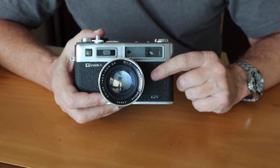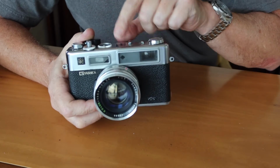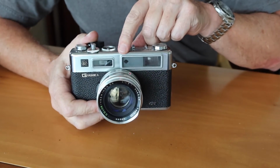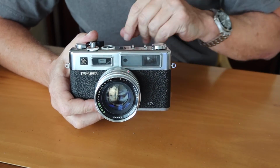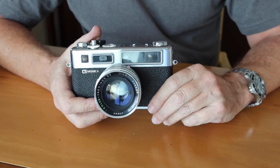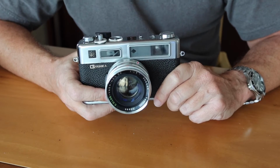The later ones were just plastic, and the rear plate and the glass were held in with the plastic just melted over the ends. I just cut off the plastic with a pair of nippers, remove the glass and the rear plate, clean everything up, put it back, and just put a drop of glue, and it holds it in place perfectly. The 2 variations look a little bit different, but the operation is exactly the same.